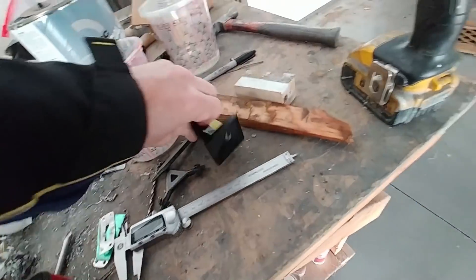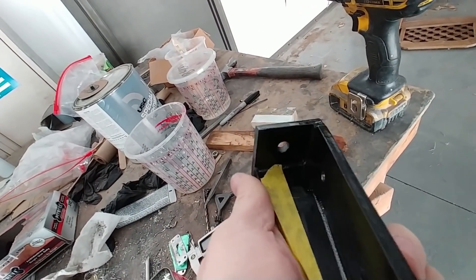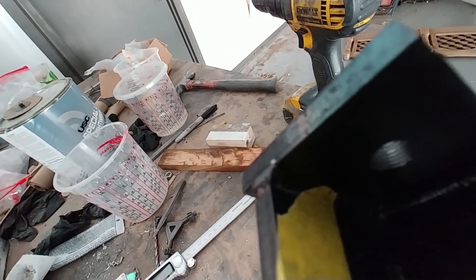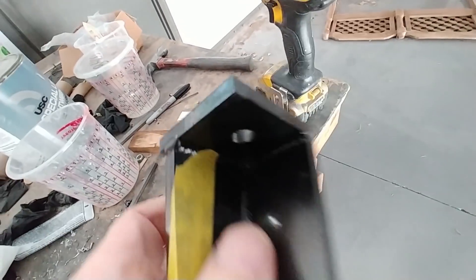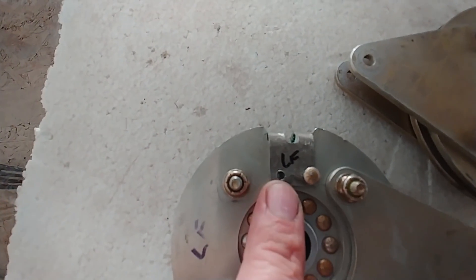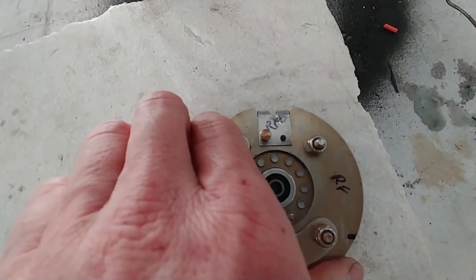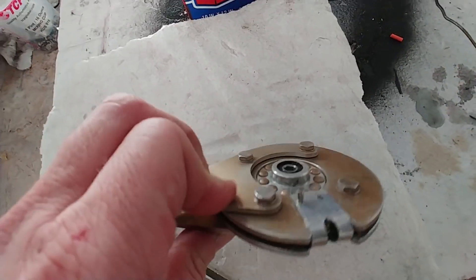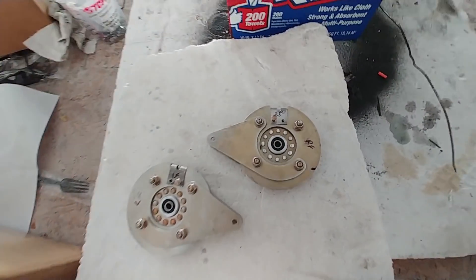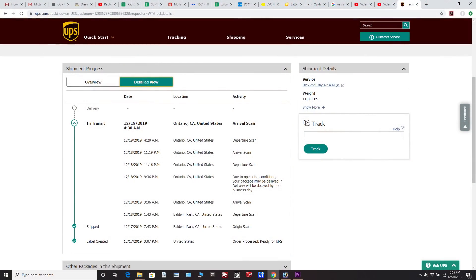There was only one other job to do before waiting for the cables — I ordered the cables, cable sleeves, cable adjusters, and some ferrules for the ends of the cable, all coming from California. The only other thing I needed to do was remake those little cap covers that hold the ferrule block or stopper on the cable. The older ones just weren't snug enough and there'd be a tiny bit of movement, so I redid those.